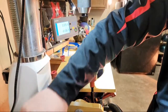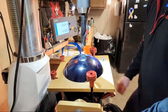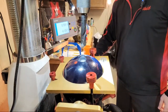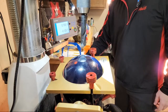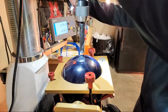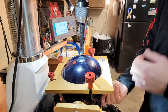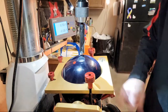That all freshened up. It's again 3/4 so that the holes are angled away from each other. So even though the bridge is a little narrower on top, it's still going to be, you know, a solid 1/8 of an inch thick and thicker as it gets down close to the bottom of the hole.